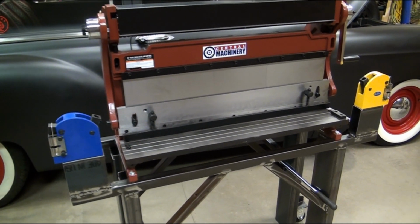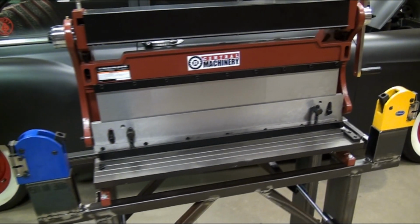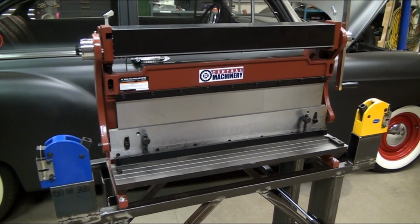One note though, and I'll say this in the next video too, whenever you get any of these machines, make sure you go through the instructions and get it all set up properly, because there is some adjustment, especially once you get it mounted. You want to make sure the blade's straight and in the right place and everything, so that when you're cutting you get a nice parallel cut there.